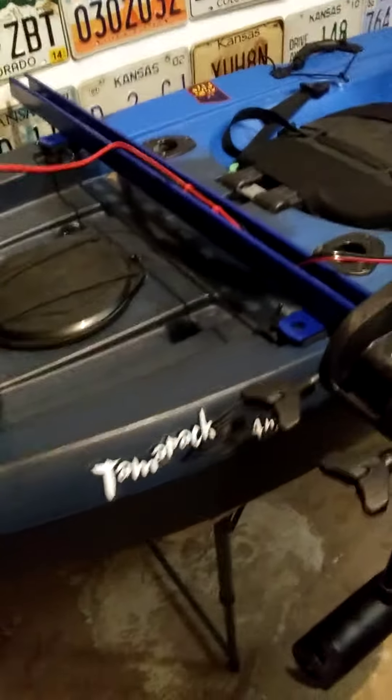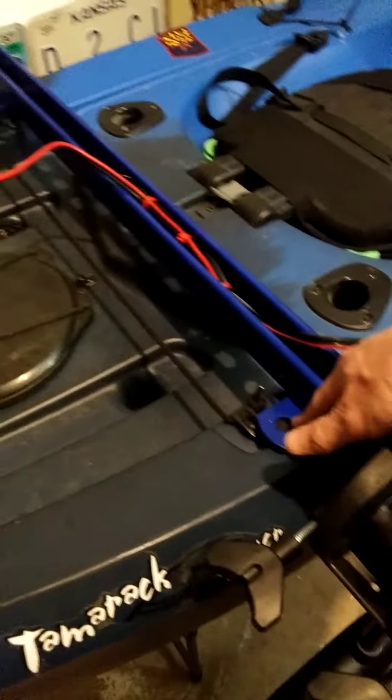I made everything kind of loose just to make this video shorter. I'm using an Endura 30-pound thrust — I wouldn't recommend using more than that. This thing was really scooting across the water yesterday. The motor was $80 on Amazon, the box was $65, the battery was $150, the unistrut I had at home so it was free, the brackets were free, and the isopads were about $13.